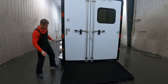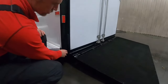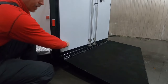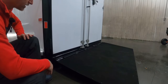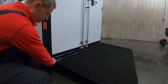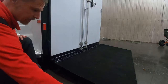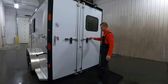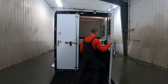We do mount the ramps at a slightly lower pivot point than some manufacturers. If the pivot point were higher, the ramp would be more steep and your horse would have a greater risk of slippage. Because of the low pivot point, we end up with minimal incline, which really reduces the risk of a horse falling or slipping going in and out of your trailer.